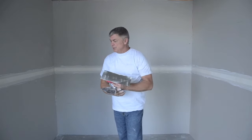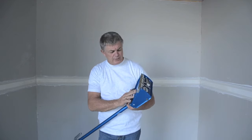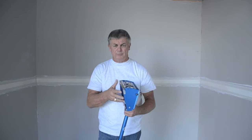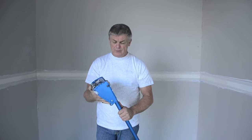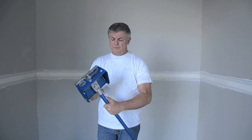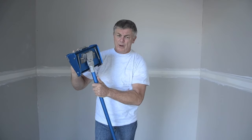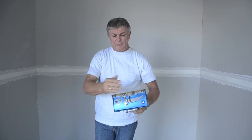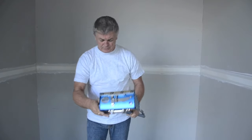So we'll step now onto the filling of the flat box — I'll grab one and just show you how simple that is. Now we've got the flat box at the 200mm or 8-inch. What we're going to do is lay it on the floor and fill it. The reason I like to lay it on the floor is I don't want it falling over and breaking because of the cost. Also, when you finish expelling material, the plate pushes in, so as you lay it on the floor it opens up, which gives you a complete cavity inside for the Mud Shark to fill with mud.